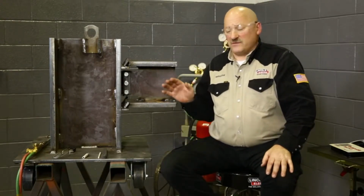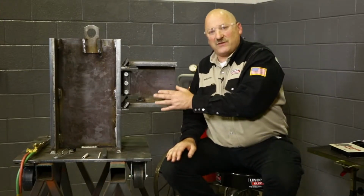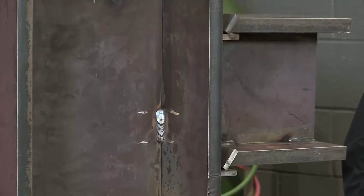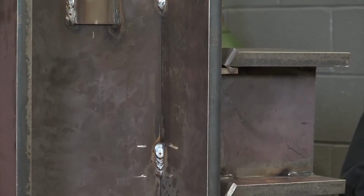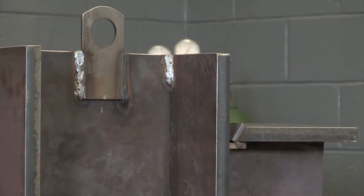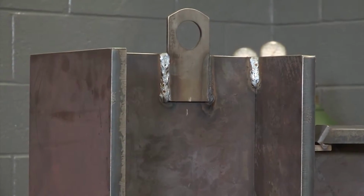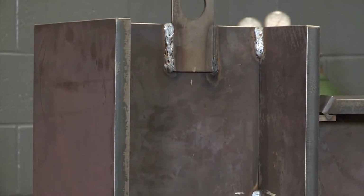And these particular grades of steel, the strength level of steel, actually, if the steel was under 3/4 of an inch thick, the minimum preheat's only 32 degrees. So if it's 38 degrees, it wouldn't require preheat. But if the temperature outside is below 32 degrees, the steel would require a 70-degree preheat to slow that cooling rate. As the steel gets thicker, from above 3/4 of an inch thick all the way through 1.5 inches thick, the preheat is only 50 degrees. Again, if the ambient air temperature outside is above 50, no preheat would be needed.